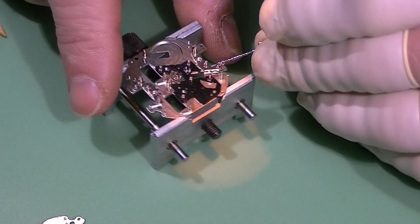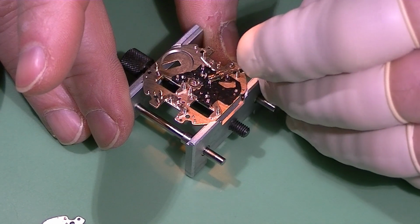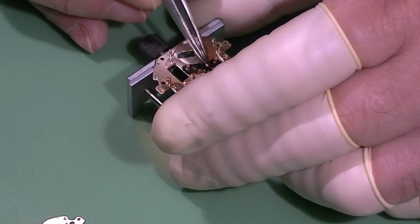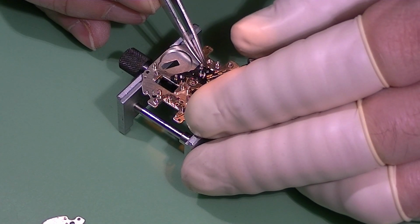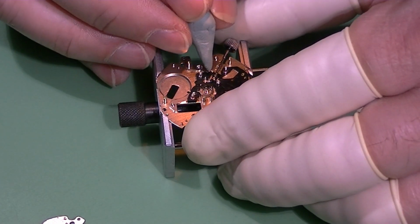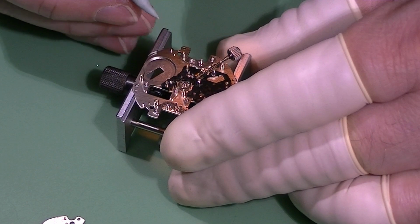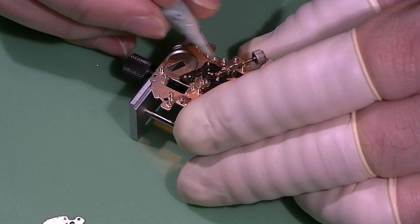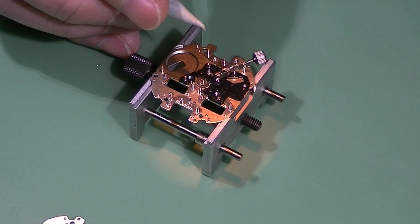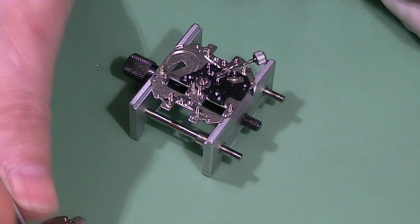What you have to do basically, the 7a38 manual doesn't have all this that you saw up to this moment. It's not included. So I'm using the 7a28 manual, which is the previous model, just to show this part and to do it correctly and to check the oiling chart and everything. But the 7a28 doesn't have a date selector. So following the previous model manual, I just completely forgot to install the date selector wheel. Actually, it's not a really big problem because you can do so later, and this is exactly what I did, and you will see it later on in the video.